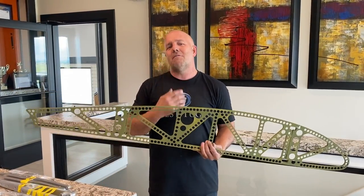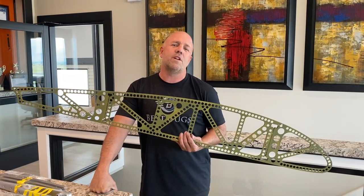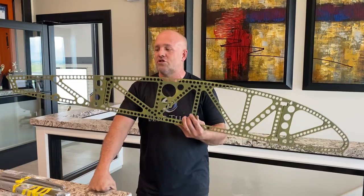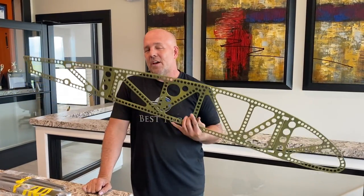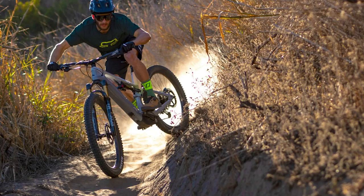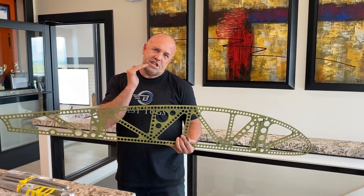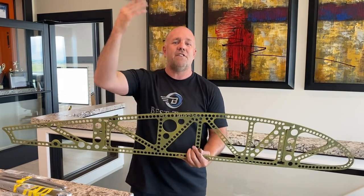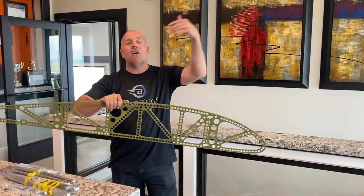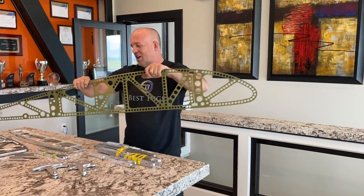Now a 25 pound mountain bike on a 4G or 5G bump, 125 pound load, ultimate load distributed out off the two tires or however you mount it. An electric mountain bike, that's a whole other level of engineering to be able to handle the amount of G's I've rated Scrappy for, that was turbulence, plus a safety factor of another 1.5 beyond whatever I add for my own safety margin. That is why I'm doing a truss web.